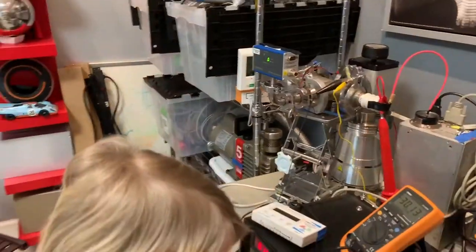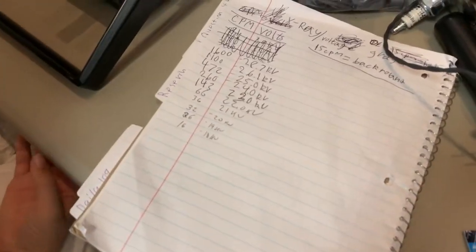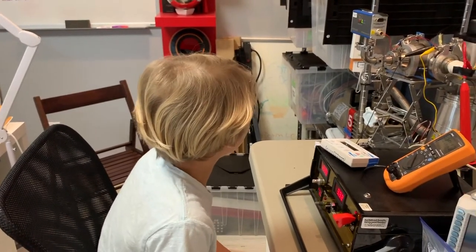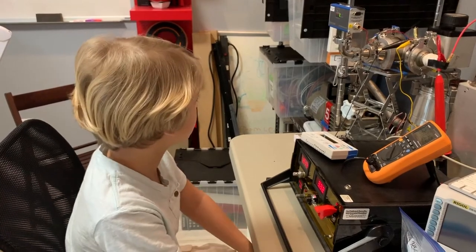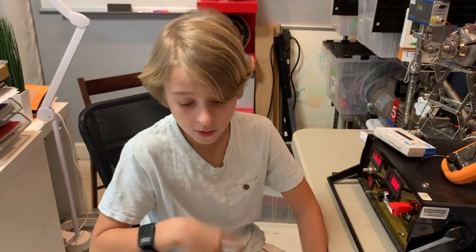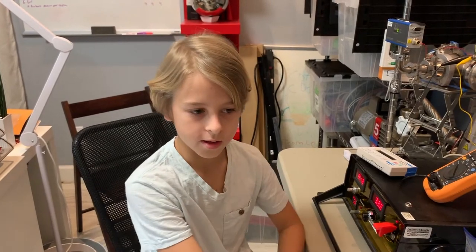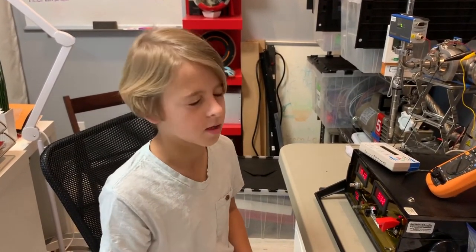At 28,000 volts it was only at 1,600 before — now it's about 10,000 counts per minute. That's crazy. The only thing I've seen that hot in this area is my uranium, which I measured at 62,000 counts per minute, but it's stored away safely. I recently measured the radiation outside the place where we keep it and it's pretty safe.